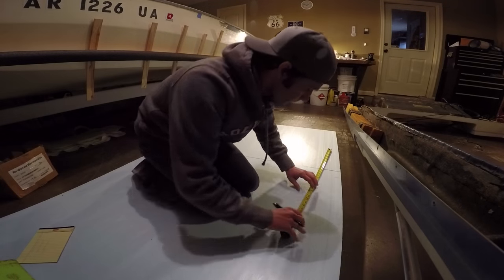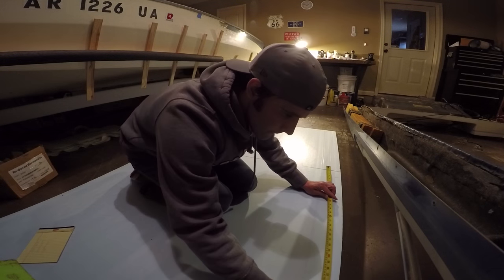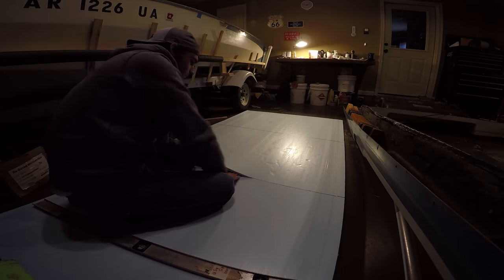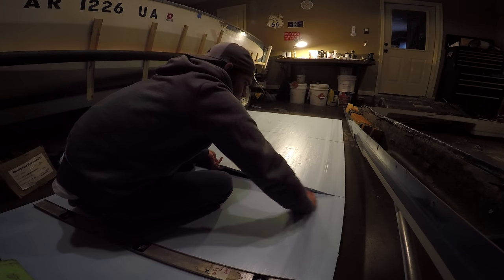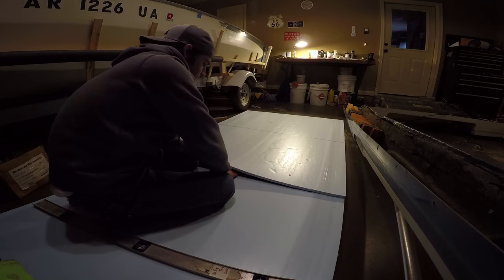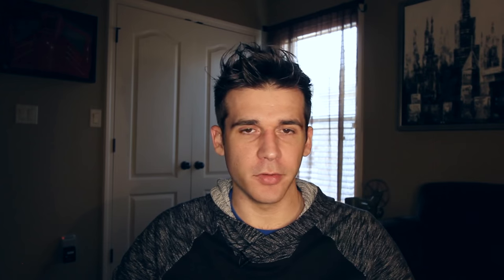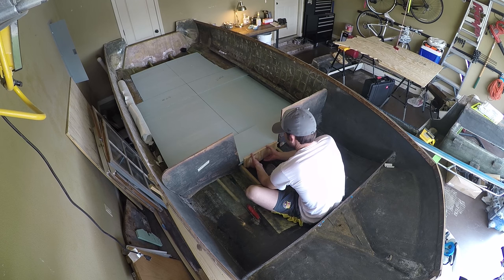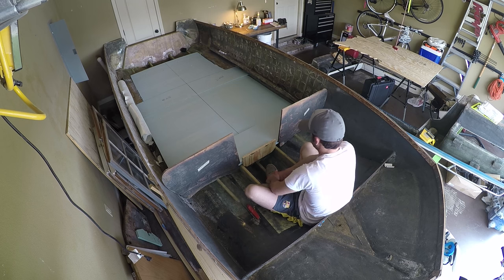I did this for a couple of reasons. One, this was kind of a practice run so that I'm not wasting material when I go to cut the marine grade plywood. Two, there were some things I needed to figure out measurement-wise for these cap supports. At the very front of the boat, I still had the cap supports from the original construction that I took out way back early on in this project. I put them back in their original spots just to see how they sit in there now. As you can see, these old cap supports sitting back in here with the blue foam.